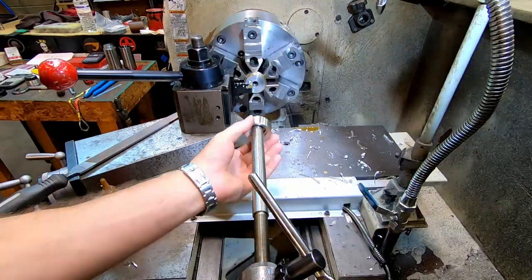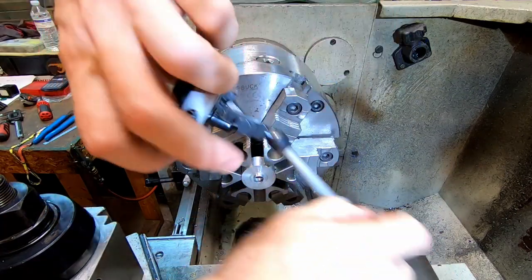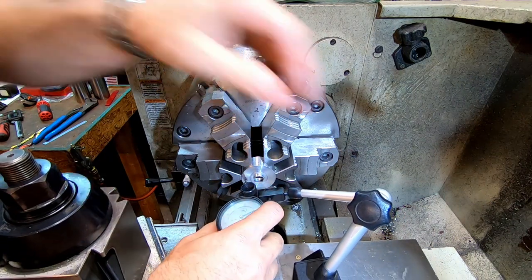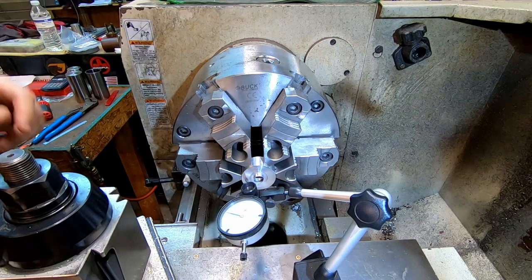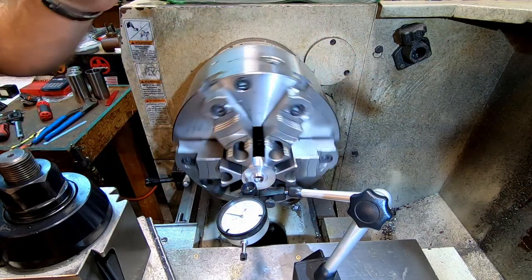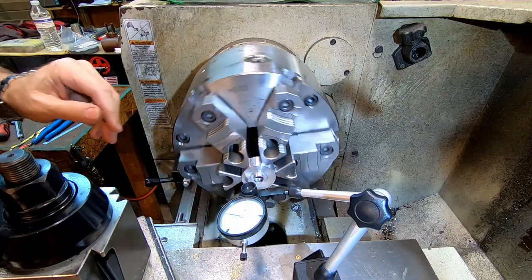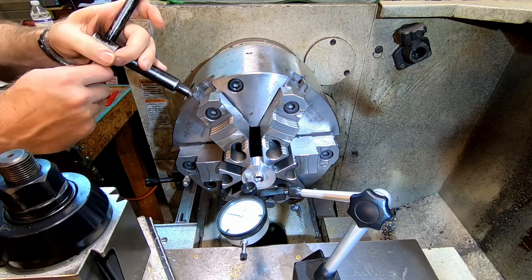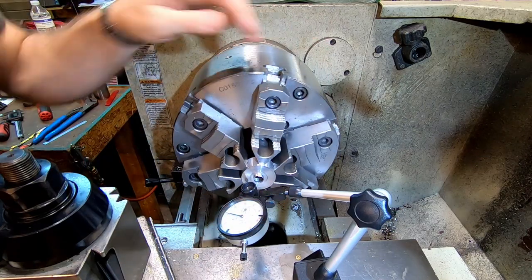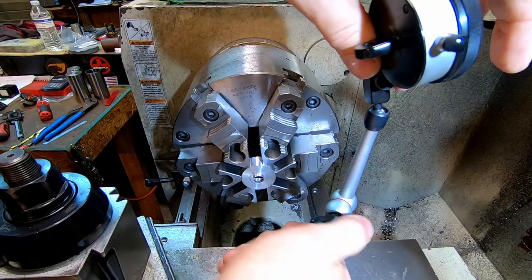There it is. Remember how I said we checked the front face of the other side of the part? We're going to do the same thing here - get it up and check seating depth, see how far out it is. It's about three-quarters of a thousandth. I'm going to live with that - I think that'll work just fine. Now that we've tightened it, let's see if it runs out less. That's rolling true - nice. That was a lot faster and easier than I was anticipating.